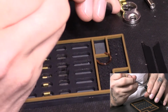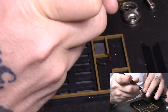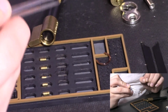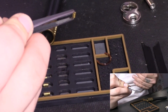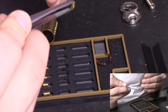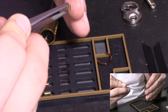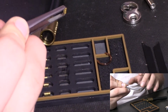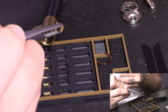Alright, so driver pin 1 is a serrated key pin. So like I said, at the end I started all the way in the back by pin 5 and I worked my way up to the front, and I didn't have to click any pin more than once. So just because there are serrations on them, what serrated pins do is they like to get caught up, so you'll have to click it again and again, and that's because it's getting caught on each individual serration. With the right tension, and when you go to pick it, you can pick it right into place, because none of those pins I had to pick more than once.